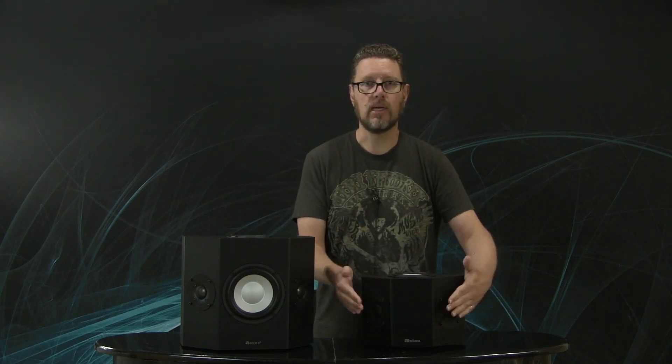So why do we call it quadpolar? It's a little different. Instead of — as in some bipolar surrounds — having a woofer and tweeter on the angled surfaces of the cabinet, we split them up. The two tweeters are on the angled sections, and the mid-ranges in the QS10, or the mid-woofers in the QS4 and QS8, have one on the bottom of the cabinet and one on the top. They are also operating in a bipolar fashion, in phase, so their output will add together at the front of the cabinet.